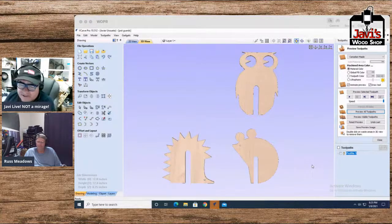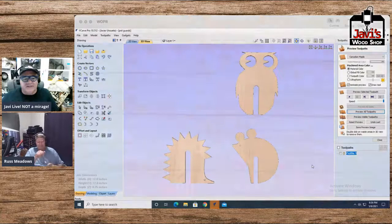You've installed homing switches. Now, first of all, let's first assume, and you know what happens when we assume, that your homing switches are either mechanical or optical switches where no matter what, they're fixed, because if they move, then obviously you're going to have an issue. So there's number one. That's a reason it may be off. Let's see. You touch the tools off. So you're touching the tools off.